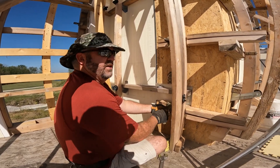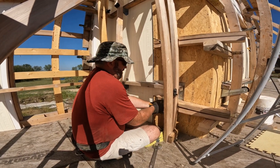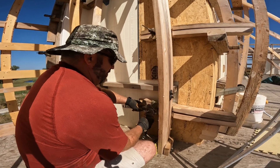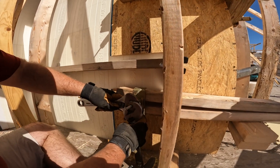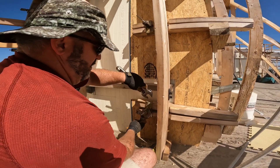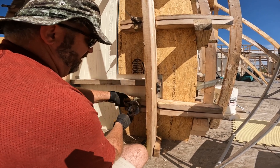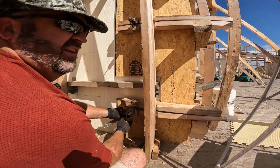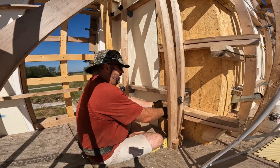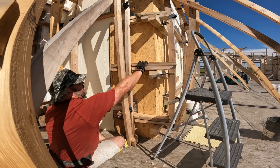So Dan is holding it on the outside — you get this pencil rod, let me get this one screwed down. I retract my jack all the way, and then you tighten that finger tight and that drives those wedges down, and then you go ahead and cinch that down so that those wedges are really driven into the pencil rod — and then it's there. So you see our board still loose, so now you start screwing the jack part of it, and you only get about a half to three quarters of an inch on each side. Did you hear that creak? That's us pulling that wood into the other wood. And then we're going to put two by fours down here that will keep these from wanting to pull away.